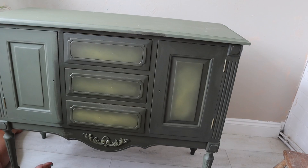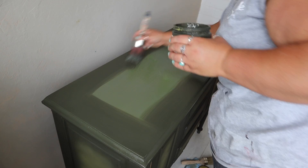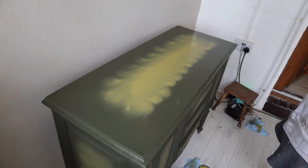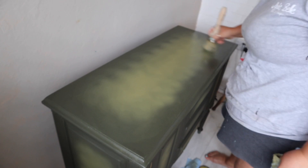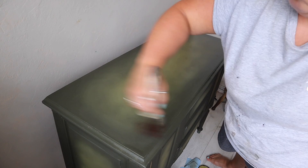With water and paint, you can always add more but it's much harder to take it away if you apply too much at once. The top is very similar to the drawer fronts - I also did the effect on the side as well. I didn't want to paint the top just one flat color; I wanted to give it the same effect but on a larger scale. The lighter color, Holy Guacamole, acts as your highlighter. I just went around that edge and merged the two, spritzing very very lightly with water until the edges between the two colors merge together. I actually put way too much Holy Guacamole in the center.